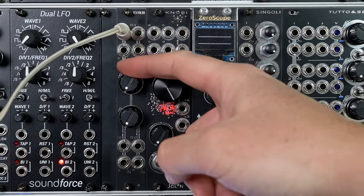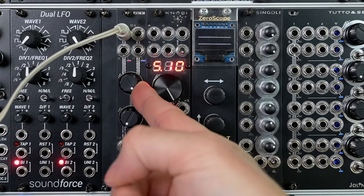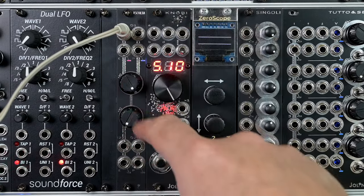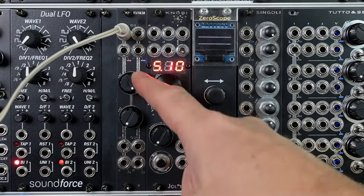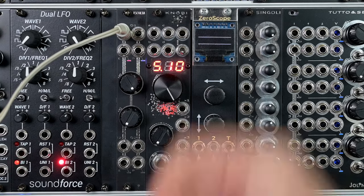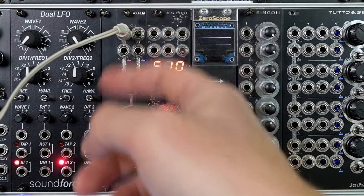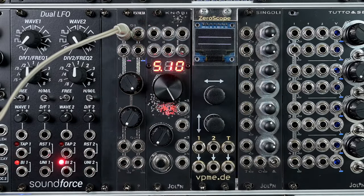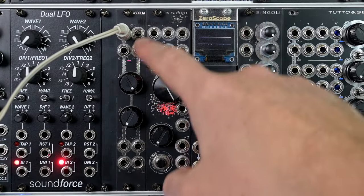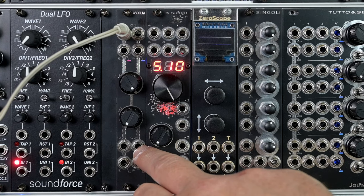Now, when I bring up this knob here, which controls the amplification, you can see that for this particular source, when I turn it completely to the right here, you can see these detectors. You can see the LEDs for these detectors light up. Because I connected a stereo signal with a stereo cable here, you can actually extract the stereo signal from this. So the left side would come out of the first output and the right side of the signal would come out of the right output.